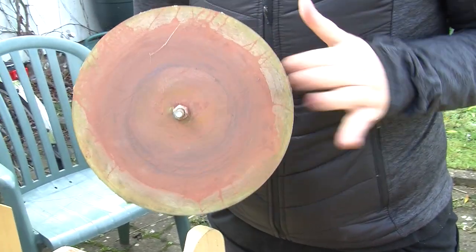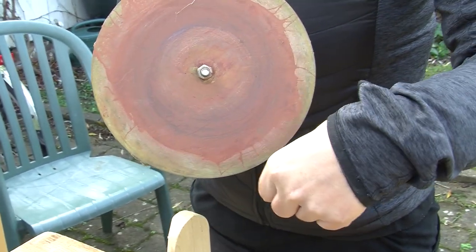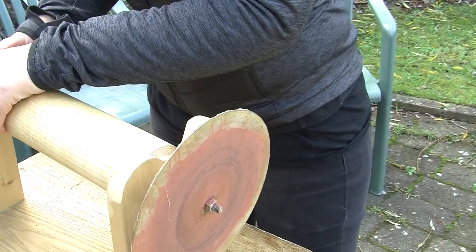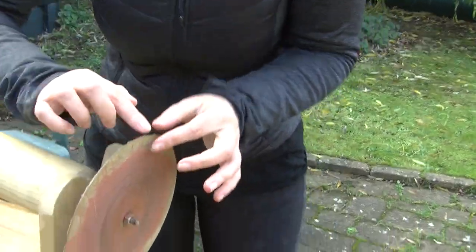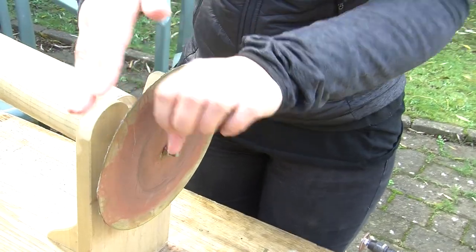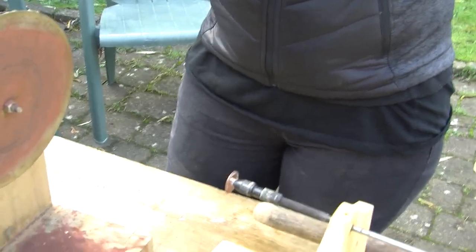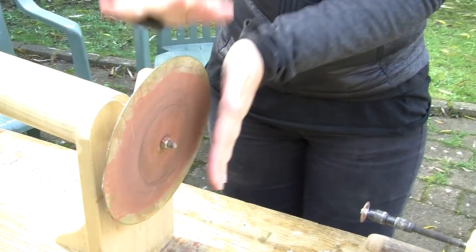This is exactly the same process that they use in China for jade. You just have to make the disc serrated, to provide more grip with the abrasion during rotation. For smaller portions, you use smaller grinding wheels. And if you coat all the surface of the disc, you can use the flat part as well, which is extremely useful during rotation. That would also be the way you could create a vessel with facets — like the wonderful faceted vase in the Getty.